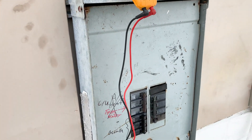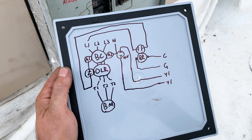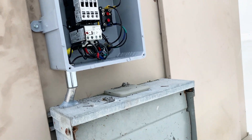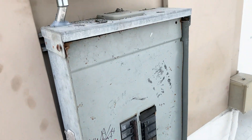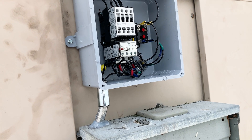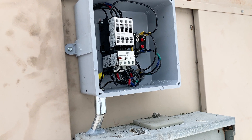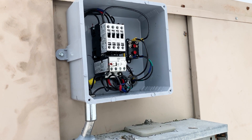That's about it for this call — I just got to button this thing up. Not my best schematic I've ever done, but it's something. It's not that complicated of an arrangement here, just a relay to pull in a motor starter. On a commercial unit like this, it's not uncommon to use a relay to pull in a motor starter or big contactors, because going through a regular thermostat and trying to pull in one here and one in the condensing unit plus all the other controls can overload the little relays on the thermostat. So this will be much easier for it to cycle on and off than directly cycling a contactor.